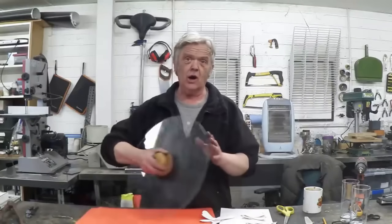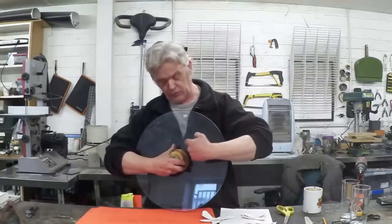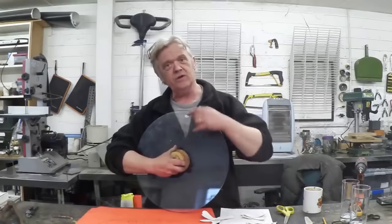There's a lot said about sector count, but I follow a Brazilian professional in electrostatics, Antonio Carlos Queiros, who says it's going to be somewhere between 18 and 40 depending on the size of your disc — with 24 to 36 being popular. To draw a template, you make a big circle and divide it by the number of sectors you want: 24 sectors means every 15 degrees, 36 means every 10 degrees. Draw an inner and outer line for where the sectors go — too far out and you get leakage, too far in and the same problem.